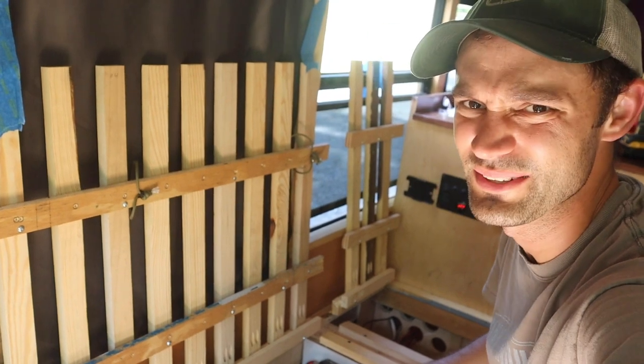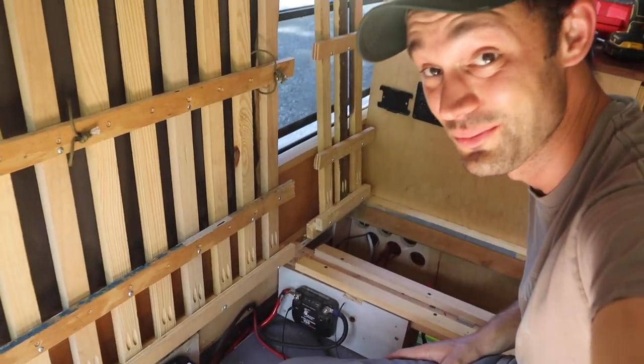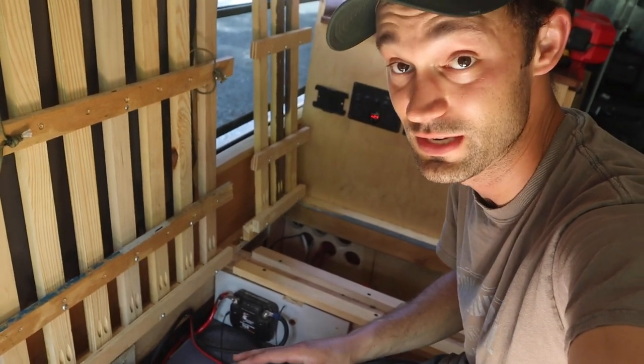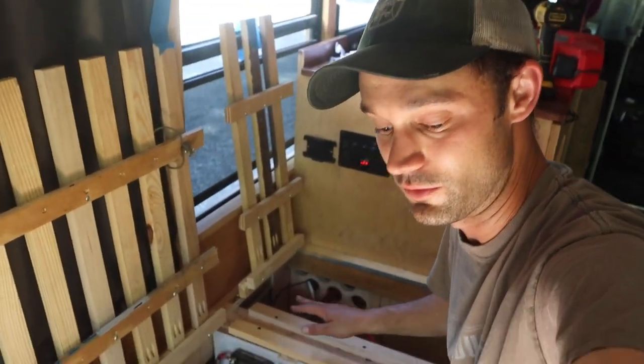That took a lot longer than expected, but I feel like that's the reality of it. It always takes longer than you expect. But at this point, switches are in, just tested it out, everything works. I'm not really gonna unwire it, but now I can go through and actually put the breakers and safeties in that she didn't have before. And then we can actually power up the entire 120 system, the inverter right here and everything.